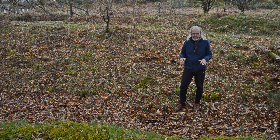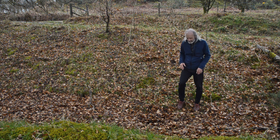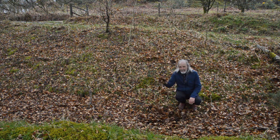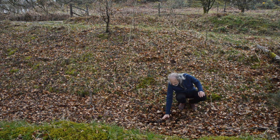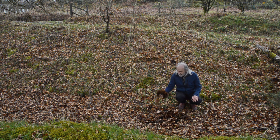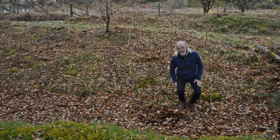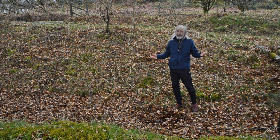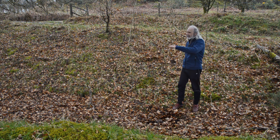What this does show is that when water comes into a place like this — with a fairly steep drop into the swale and then a gentle fall away — you get an accumulation of material. There are a lot of leaves here from the trees, and further down it's a very nice material. Over time this whole area will fill up and we'll end up with a terrace, which is actually a good thing — water slows on the terrace and the ditch is no longer needed long-term.